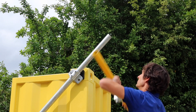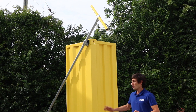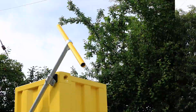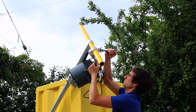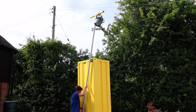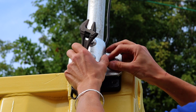Now we feed the long scaffolding tube through the top tube clamp, and fit the T-section to the top of the vertical tube, doing up the grub screws. Usually at this point we'd lift the pole up, secure it into position, then get up there and hang the light from the horizontal. But since I don't have ladders high enough and it's the middle of lockdown, I'll show you this other quick easy way: attach it first while the bar is still at an angle, then since it's not too heavy, lift it up and get it into position. We can then pass the tube all the way through the top tube clamp, lower it down into the bottom one, and put the final screw in the top domino.